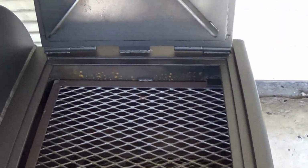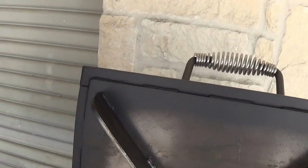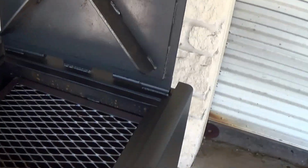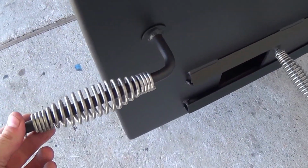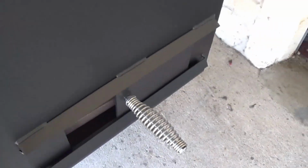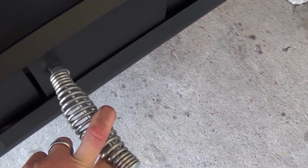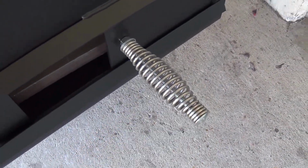You see our fireboxes on our 24-inch smokers come standard with our grill top. They're flanged on the inside and then again on the outside. Inside of the lid is reinforced with 2-inch quarter inch plate to keep that from flexing over time. Again, cool touch handles. These are stainless steel, not the cheap Chinese ones. These are all American made stainless steel handles, 304. Same thing on our damper adjustment.